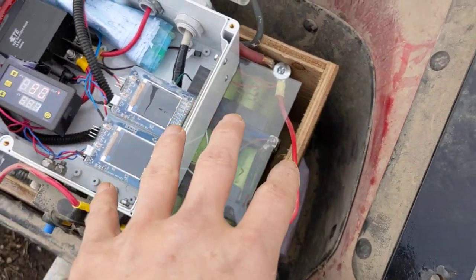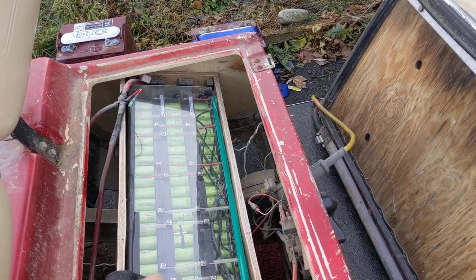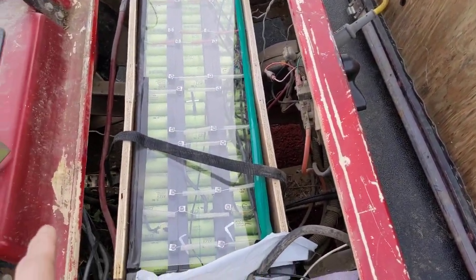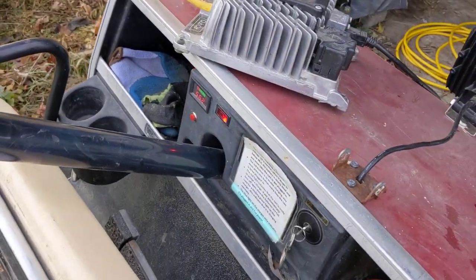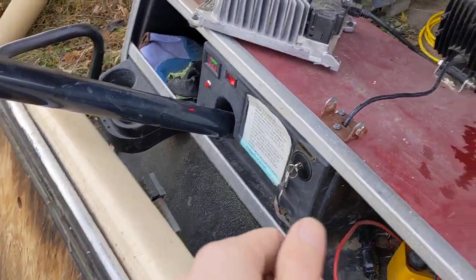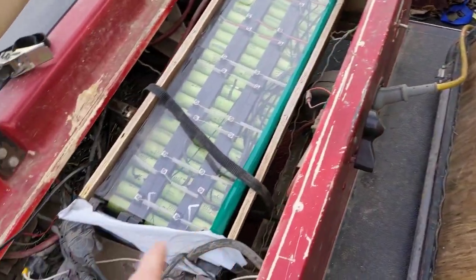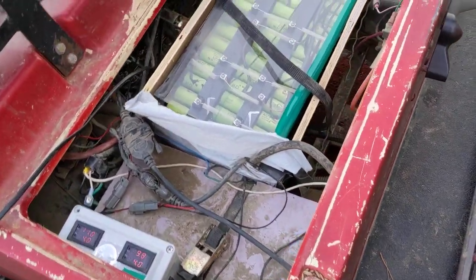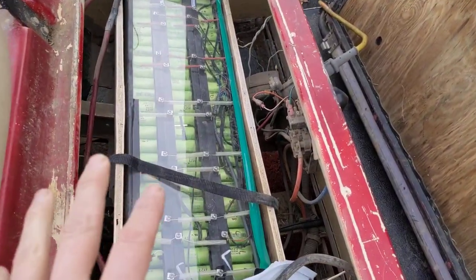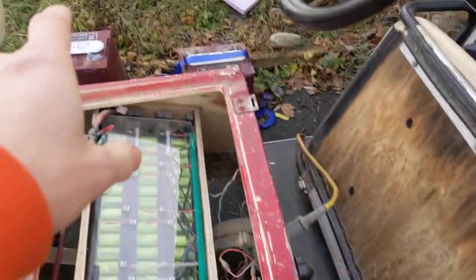This pack at the back is representative of the whole thing. It's a 48-volt system — that's six 8-volt cells. But I did some tests when it's doing its equalization charge: it goes over 60 volts, at which point the controller and the motor cut out. This voltmeter is telling me what the battery pack voltage is — I installed that while I still had the lead acid pack. At 59 volts, no problem. I could turn the key and start driving even though it's plugged in. But as soon as it hits 60, it has this over-voltage cutoff. So all I need is to size a battery pack that, at its maximum charge, is below 60 volts, and it'll run just fine. And it does — it runs great. This has a lot more oomph with the loss of weight and more amperage available because there's much less sag. When it sags, it's still way over 48 volts versus those sad sorry things.